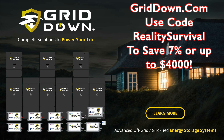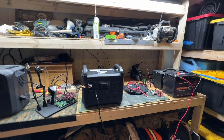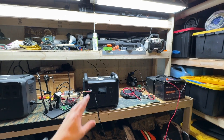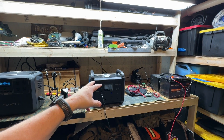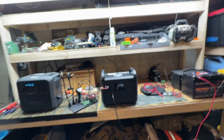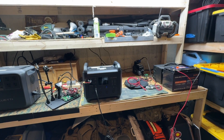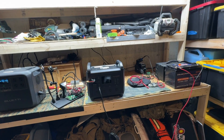I'm even thinking you could get a couple of 200 amp-hour batteries, wire them in parallel, and you'd have a massive system. It's not going to give you a larger inverter output — you're still limited to 1600 watts out of this unit — but it could run for a very long period of time. You could probably run your refrigerator for a couple of days.